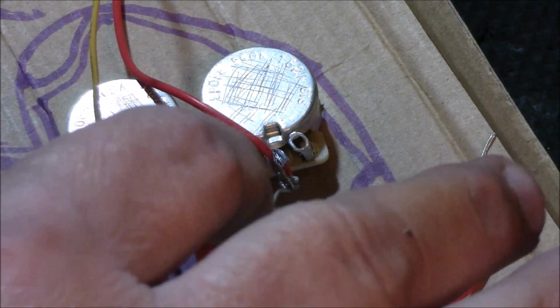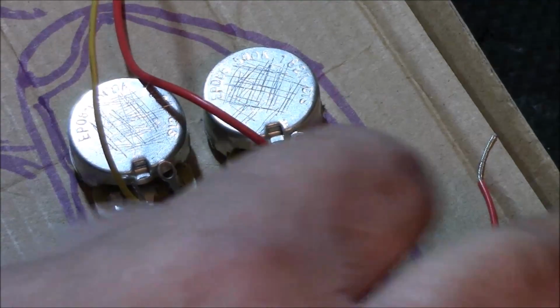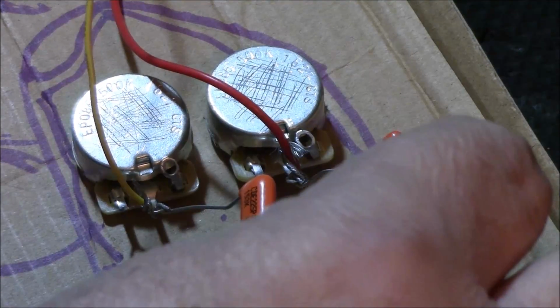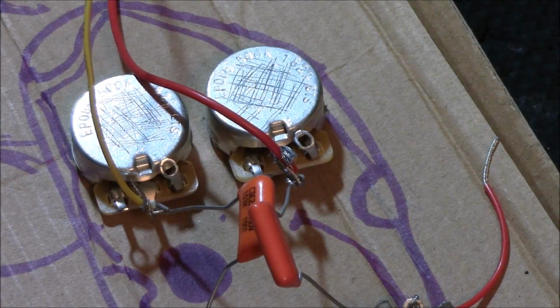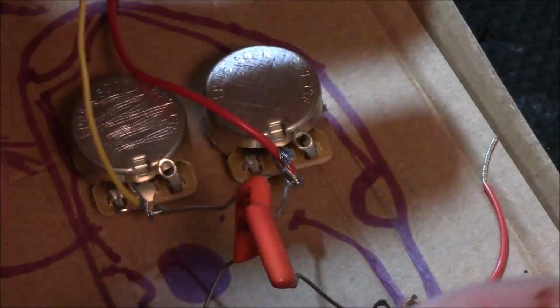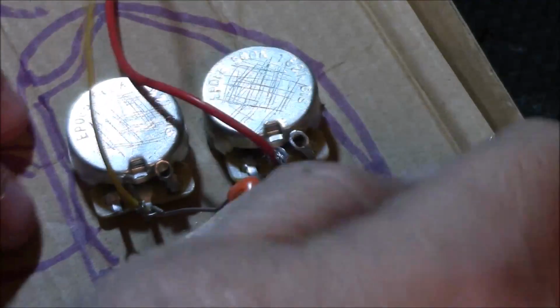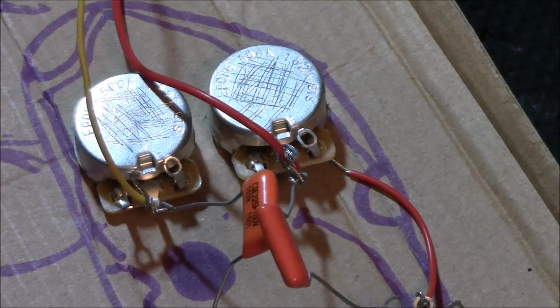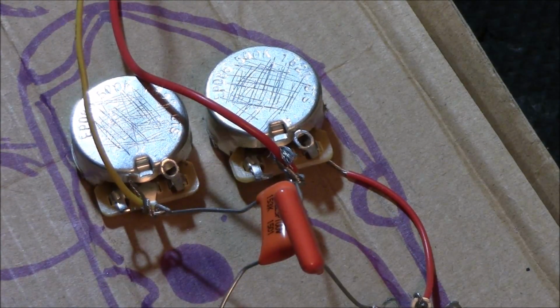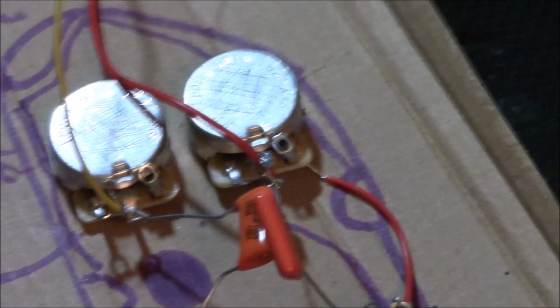And right at the moment, I've got a lot of lead on these capacitors. And I've got to take those off, cut those leads down before I do any soldering work. So I've got to get this into a compact area, right? I've got to get these much closer to one another. Now the wires themselves, these wires that I'm showing you right now, no big deal about twisting and bending those to fit within a cavity, as long as you don't push too much against the solder area. But these caps with their hard legs, yes, that's a different issue altogether.